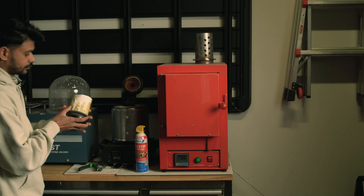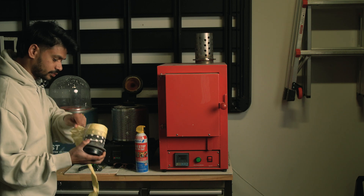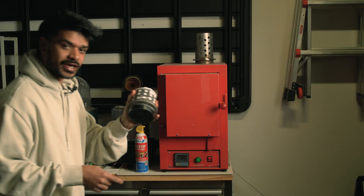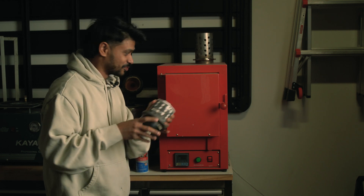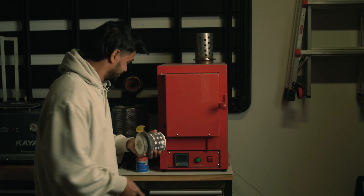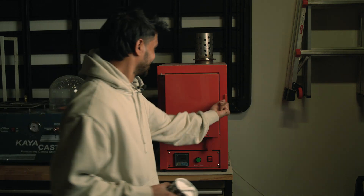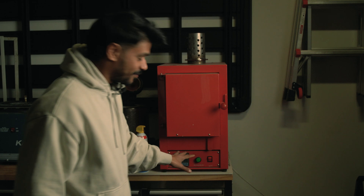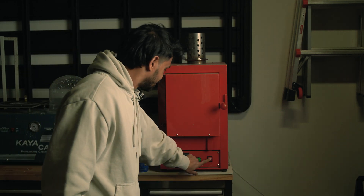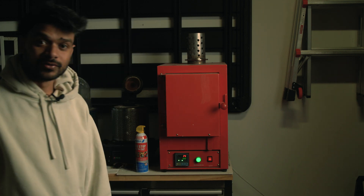Notice the investment dried out on the side of the flask — that was because of the mistake I mentioned previously. Don't forget to take the rubber bottom off before putting it in the oven. I've actually done this mistake before where I just popped it in like that — you can imagine, it wasn't a pretty sight. The flask is in, I've already set up my burnout cycle, so just turning it on. Be back in eight hours.